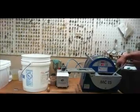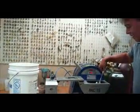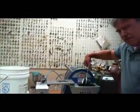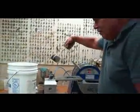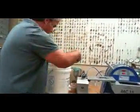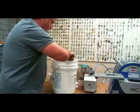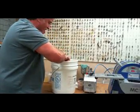Alright, I brought our quenching bucket out because we're going to take this hot model out of this flask. And again, our investment's real hot. We're going to crack all that away. So, quench it in here. Give it a little help. Oh, this is hard as a rock.